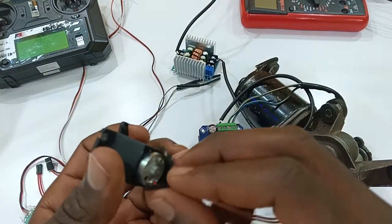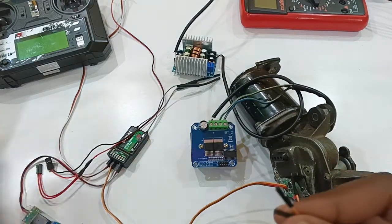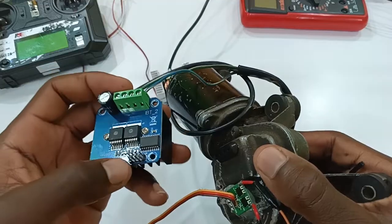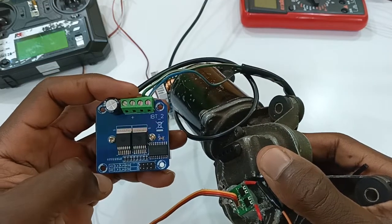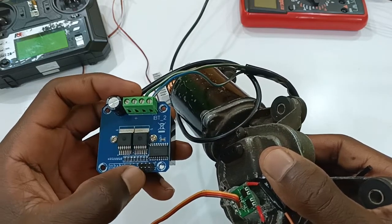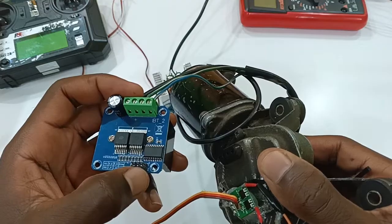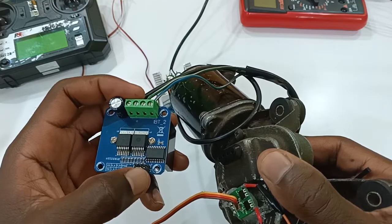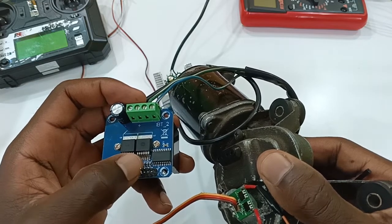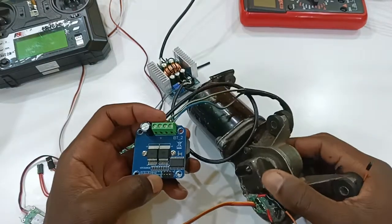These two wires are supposed to be in the motor, so you'll have to extend the cables and plug them in here. We'll plug power to the first two pins — down will be ground, up will be voltage. Then we'll skip the two pins in the second column and go to the third column — both pins will plug in the positive of the power feed cable. For the motor, plug in the last pin.